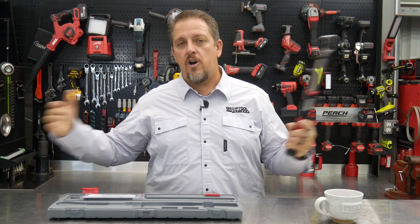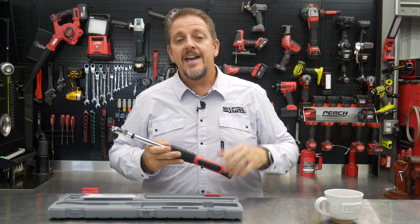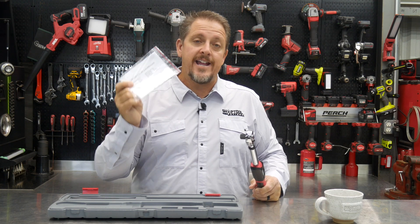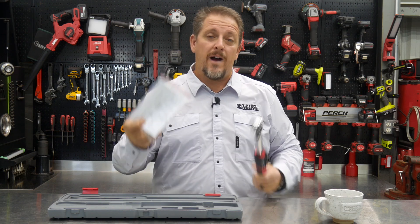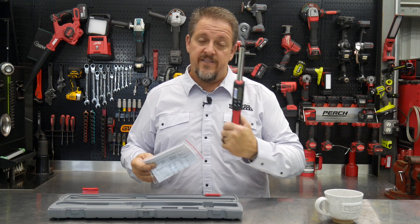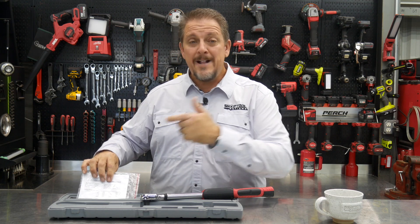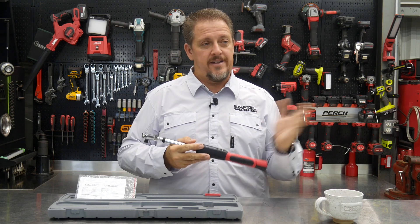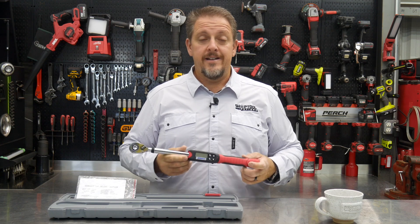This is probably not one you want to put wheels and tires on with — it's just not going to have as much leverage as a larger torque wrench. Make sure you always get a calibration card with your torque wrench, whether buying new or used. If you don't know that 50 foot-pounds is really 50 foot-pounds, you could damage something way more expensive than any torque wrench. This one was within 1%, which is pretty unheard of — it was dead on all the way through calibration.